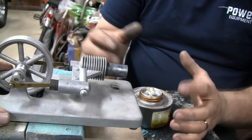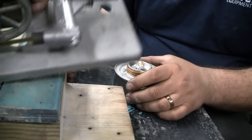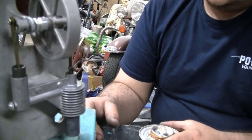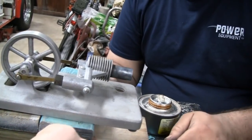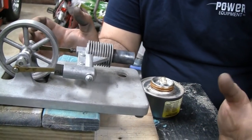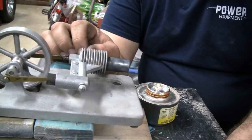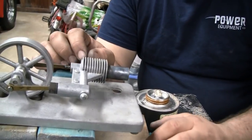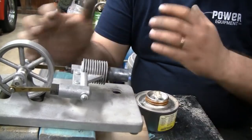It's the same air in the system — there's no intake and exhaust. The same molecules of air just get warmed up, expand, then cool and contract. The Stirling engine we've seen had a water cooler on it — that was a pumping engine. That engine would develop much more power than this one: one because it's much larger, but also the water being pumped actually helps cool half of the cylinder. This one is air cooled, but the other one would be water cooled. So you have a much greater temperature differential between the hot area — heated by a fire — and the cool area cooled by water, which lets you develop much greater power.